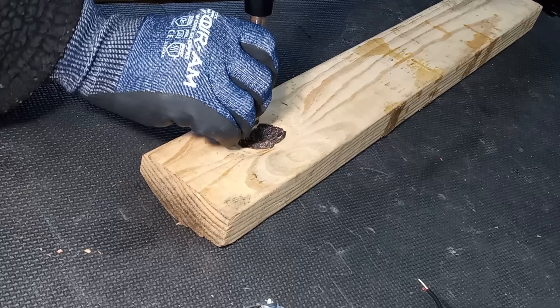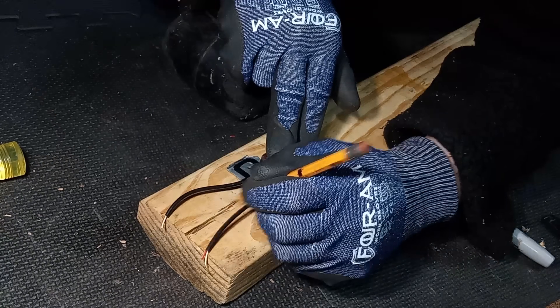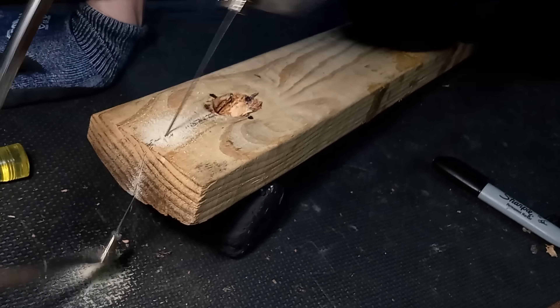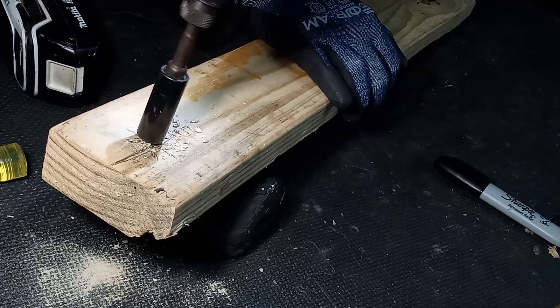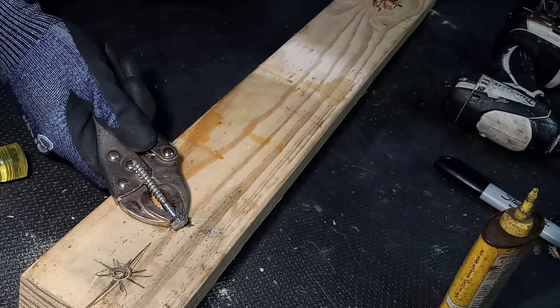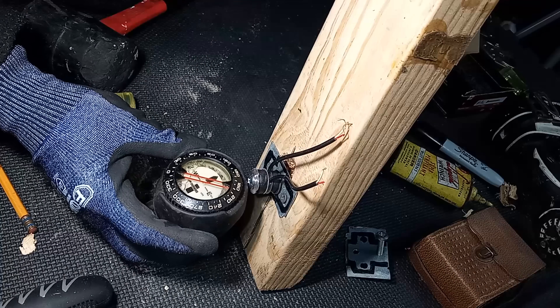To test this stuff, a fellow might need a guitar. This knot hole looks like nature's pickup route, so I start digging it out with a chisel — whacking all about the place, knocking chunks out, test fitting the pickup, whacking some more. Eyeball the center line and select a piece of rusty antenna pipe to use as a bridge. I cut a slit along the bottom end right down that center line — this is my tailpiece, I guess. This object is called a diddly bow, by the way — made back in the day by Delta blues players in Mississippi. What you see me run into the pilot hole is a lag bolt. I'm using it to cut threads, then I'll pull it out and drill a hole in the shank right below the head — that becomes my tuner. I quickly installed the pickup with sheetrock screws and checked polarity with a compass.